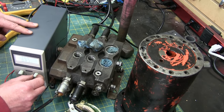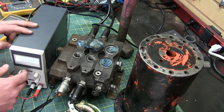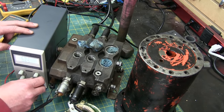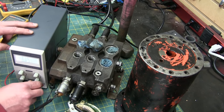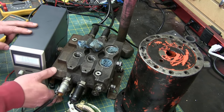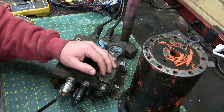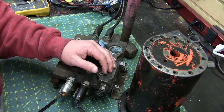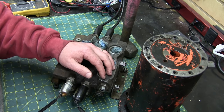This might be AC. No, it wouldn't be AC because you want to be able to control it, so it's got to be DC. At 30 volts, almost an amp and not moving. Well, time for plan B. Looks like I was a little anemic on my estimate at first blush — you don't want to blow the thing up, these are hard to come by. So we need a DC power supply with more grunt.